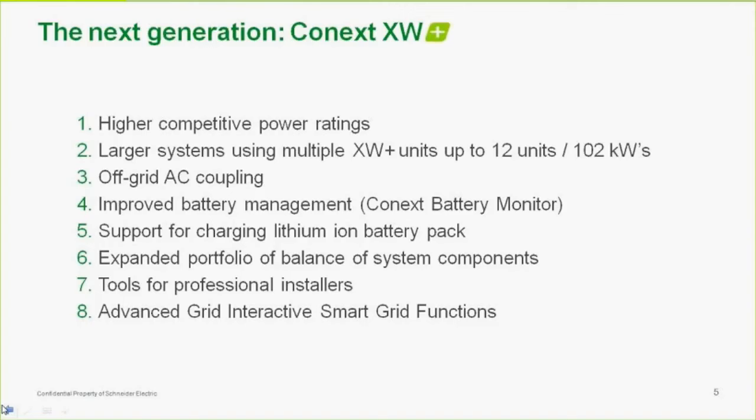So what we do is we have a programmable setting: when you select lithium-ion, we actually have the ability to set the maximum number of amps you want the inverter to allow before it shuts off. And you do that at a value lower than the battery bank uses for disconnecting. So instead of opening up the relay, we just shut off the loads, leaving the batteries connected. So that's the first one.